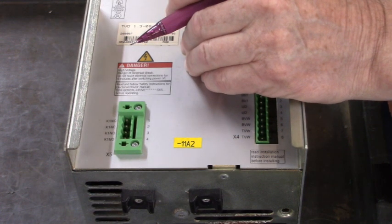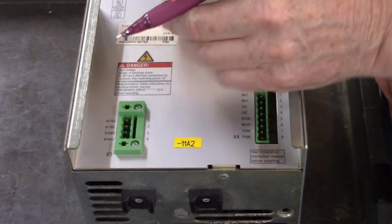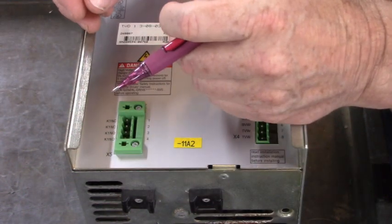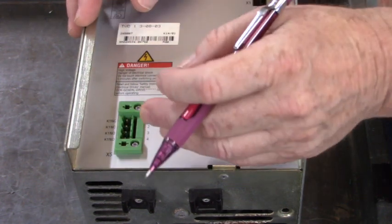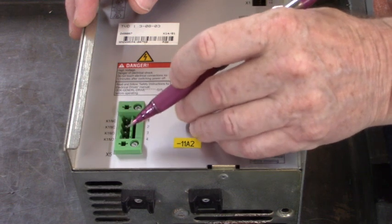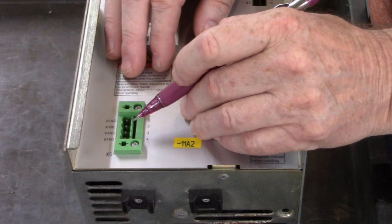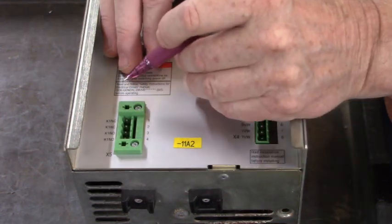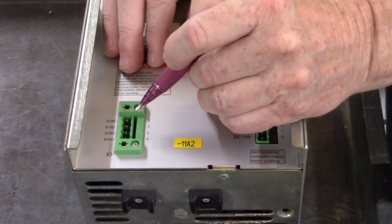Now, part of that auxiliary contact is a normally open contact who, when closed, goes back up to the control board and tells the control board that the main contactor is energized. So when these contacts right here have gone bad with high contact resistance, it's probably a good idea to go down there and clean that auxiliary contact assembly.